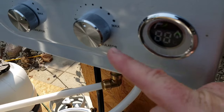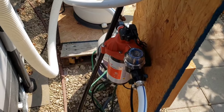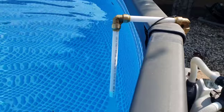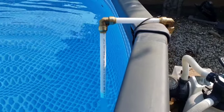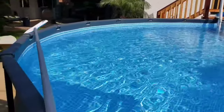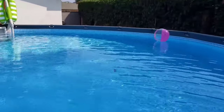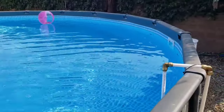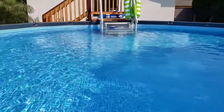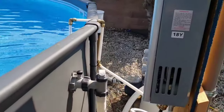There are different settings and I found a pretty decent flow rate that suits us — the pump seems to like it. This is the first time I've set the system up like this for an entire day to test it out. From what I understand, it'll give about a one-degree rise in temperature per hour. The ambient temperature here today — a mid-September day — is about 65 degrees, so I'm expecting the water temperature to go up at least another 10 degrees by tonight. Because of the sun and everything, the pool is actually about 72–74 degrees right now, which isn't bad, but I'd like to get it closer to 80 for some nighttime swimming.